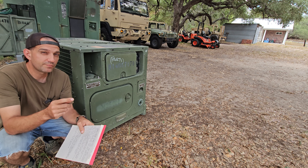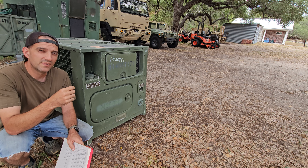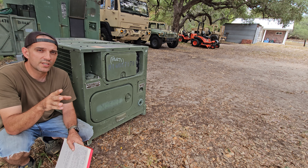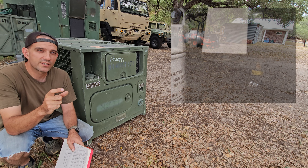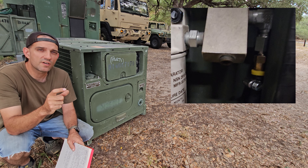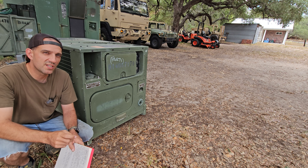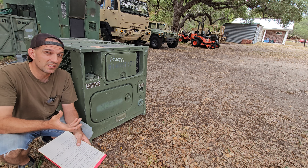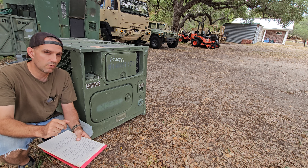The other thing was the new return fuel line I made leaking a little bit during the test. I don't think the fuel line itself was actually the problem. There's a weird, overly complex T-block they use with a plug and stuff in it — I'm thinking that block may actually be where the leak is coming from and it was running down from there. It's pretty uncommon for a hydraulic line, especially just used for fuel, to spring a leak unless it's really old. My hose clamps and stuff were tight on the one I made, which made me go back and look.